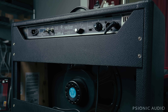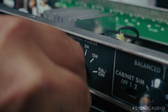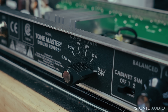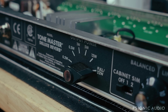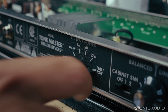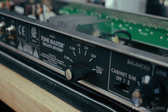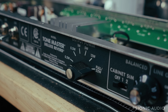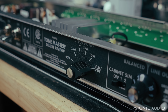Taking these apart is just about the same as taking apart one of the standard tube versions. People online often say this is a 100 watt amp — no, it's limited to the relative output of an actual 22 watt Deluxe Reverb. On a Deluxe Reverb, that 22 watts is measured clean; the amp actually puts out 30 to 35 watts when you push it hard. And this has been limited — how do I know that? It ships with either the Neo 12K or the Neo Creamback speaker, and the Neo Creamback is only rated for 65 watts. They're not going to ship a 100 watt amp with a 65 watt speaker. They'd just be killing speakers all the time.